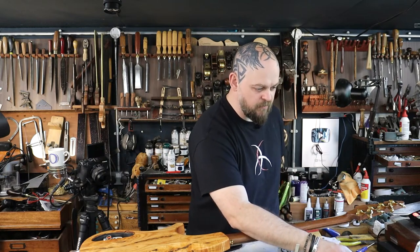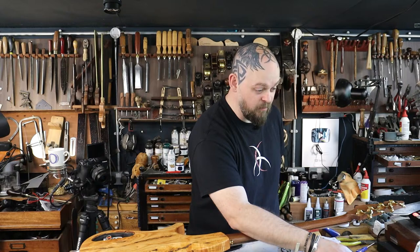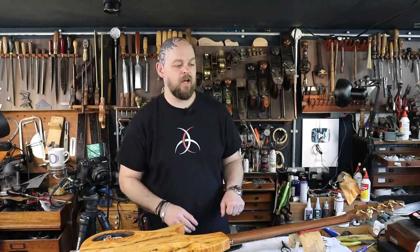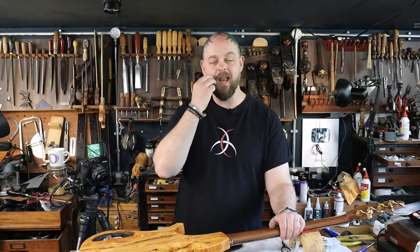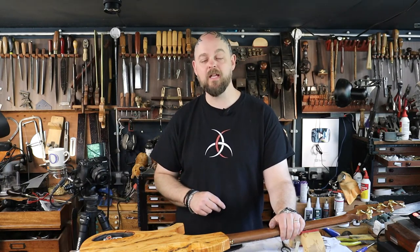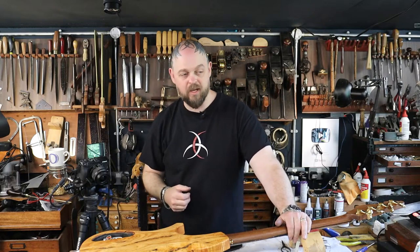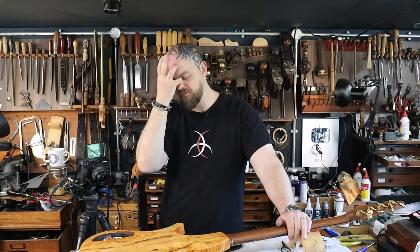AFI says, okay, I have a question, if I may, although I have a feeling you may not be able to help. Know of any good gold nitro finishes that are available in the UK? It's hankering for my next project. Okay, so use any nitro lacquer you want. It's the substrate that just has to be compatible with nitro. And most sprays will go underneath, so most paints will go underneath a nitro varnish. So I was at a local hardware store the other day buying paint for something else entirely. That heat paint that you put in, you don't need to know.